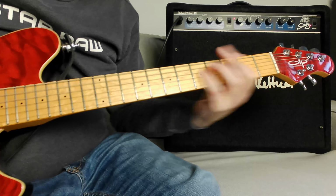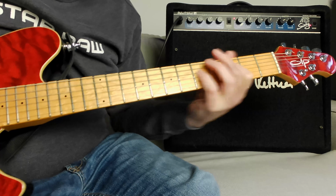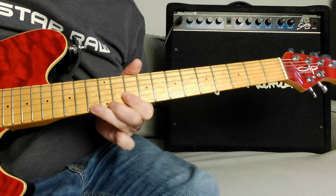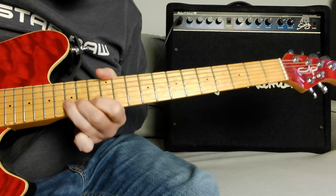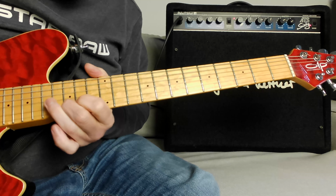The hardest part of this repair was figuring out how to get the amplifier out, so I may have saved you some time repairing your own amp, which is why I love these repair videos so much. If your amplifier has the same problem, see if cleaning the pins of the tube solves it.